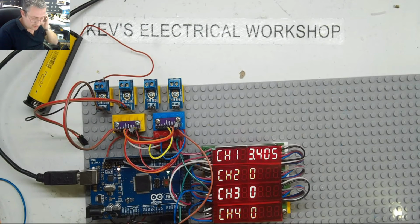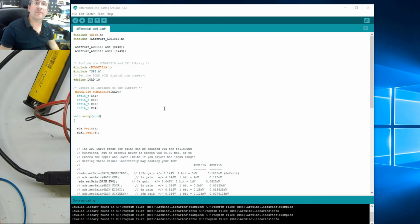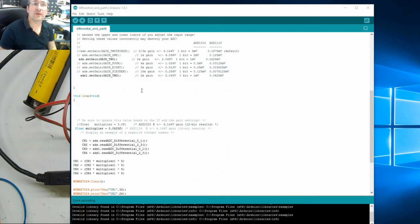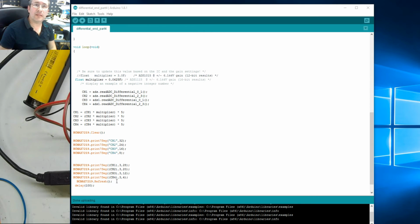Okay, well, welcome back. Well, I didn't resolve the issue. It does look like the library could take a maximum of 2 variables at a time. Anything more than that, and it would just spew out what you put in and didn't do anything at all. So I've actually reverted right back. I mean, this does quite often happen in good old development. I've taken the library out, removed the extra variables, the CH1A to 4A, and it's just very basic now. It just reads the values, we do the multipliers times 5 and basically display them.